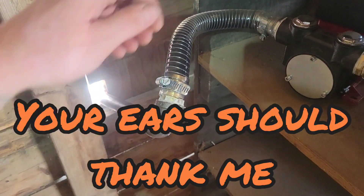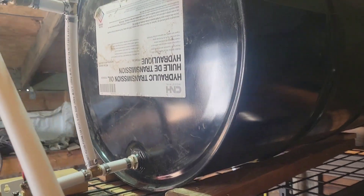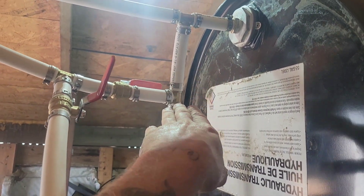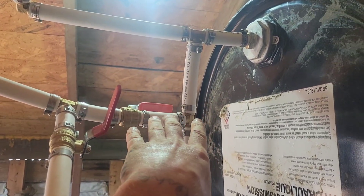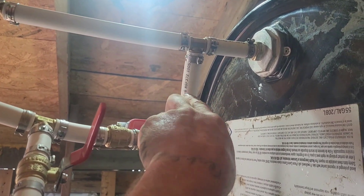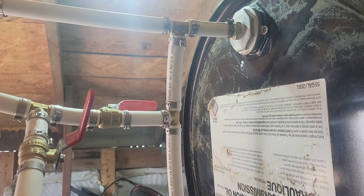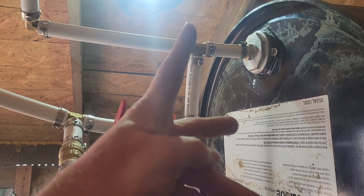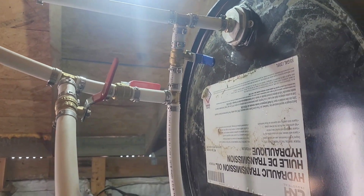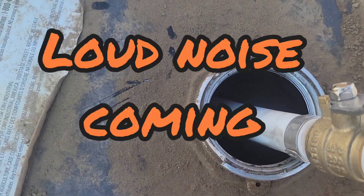Let's run it. That thing is loud. So I think I've found my first mistake in my design. The oil comes up through this line into the tanks — I was thinking it would go down this way and allow it to vent up there, but it's actually just pressurizing because it's going up that way and down that way. So I'm going to snip here and put another valve so I can shut it off there, and it'll just come down in that way. Leave that as a vent so it'll fill and push air out that way instead of the oil splitting and pressurizing my tank. For anybody wondering why I've got this external piece from the bottom of the top drum, it's so that I can see the level inside my drum since I've got a solid metal drum I can't see through.